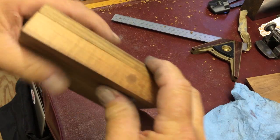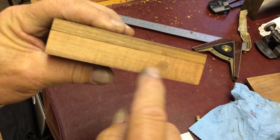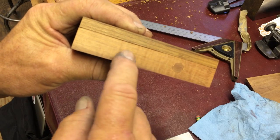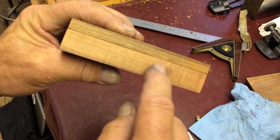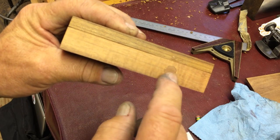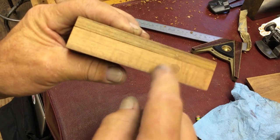That's where I plugged the hole — there was an old dowel in that piece of wood. I was recovering a piece of Hawaiian koa and I cut out the white hardwood dowel that was there and installed a koa hardwood dowel to match.